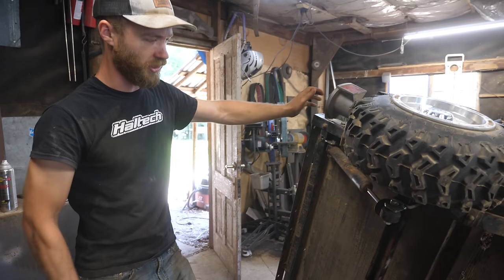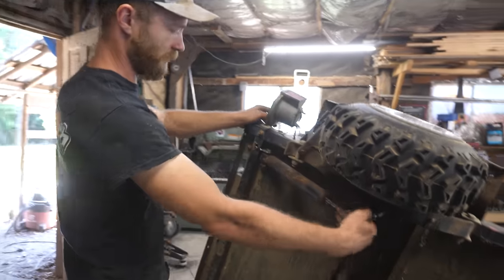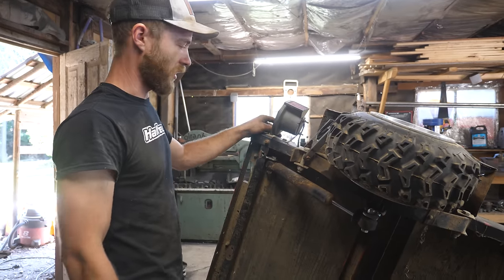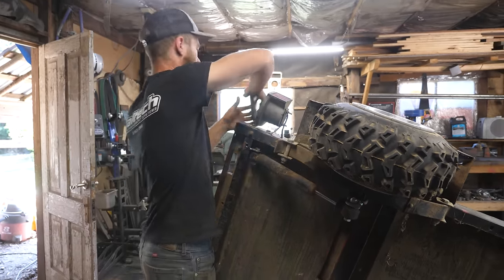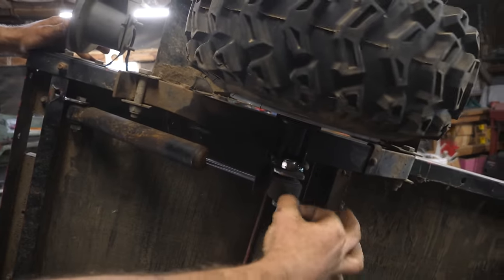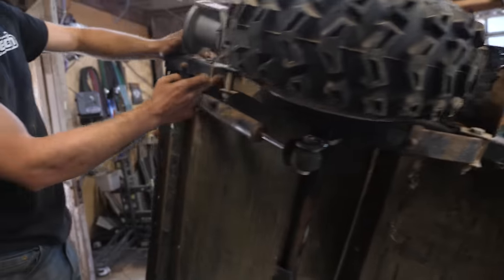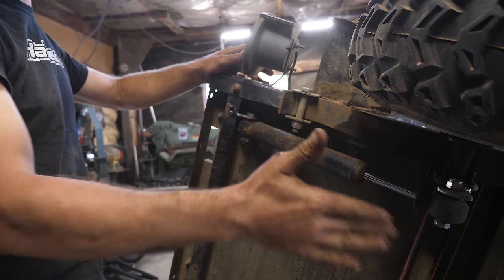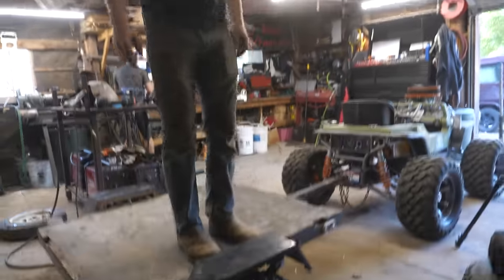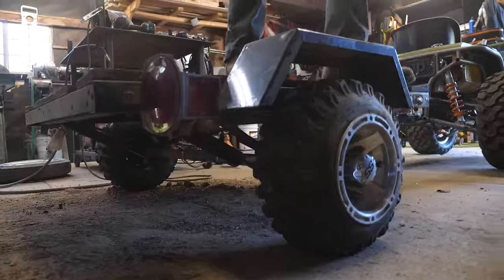The Overland trailer has shocks. Obviously they're really long because they're from a car, so they're at a pretty extreme angle compared to the axle, which reduces their effectiveness a bit, but still better than no shocks. Also, they're on the back because that's the side of the spring that slides. The front of the spring is wrapped solid around the bolt, and then at the rear, you can see when it compresses, it slides back and forth, so it'll slide backward, which is the direction that it'll push the shocks. Can you see the shock compressing if you look under there? Yep, a little bit. Cool, well, that's something.